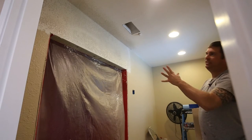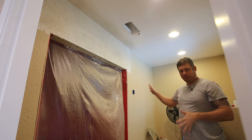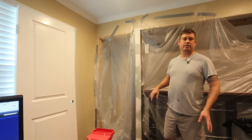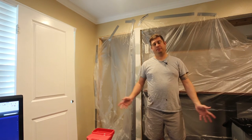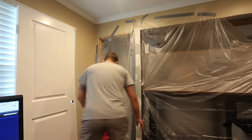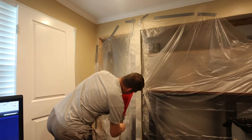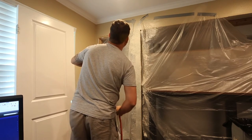I'm going for a heavy texture, so I'm basically done at that point — that's all there was to texturing this space. I'm going to break down my equipment and move to the next space, spread some protective blankets out. This next spot is going to take about 30 seconds to spray, so I'll hook up my machine, get it sprayed, and then take down this masking.